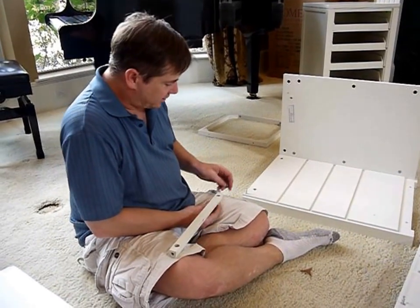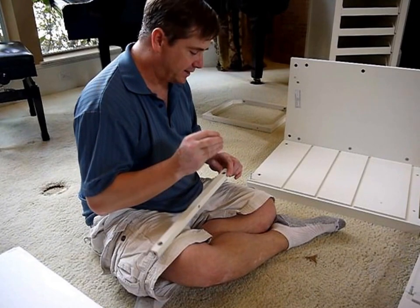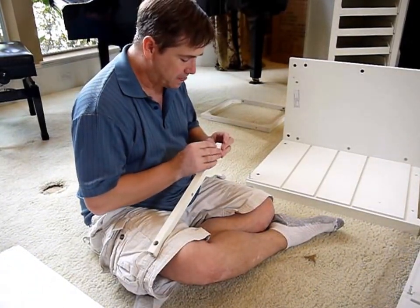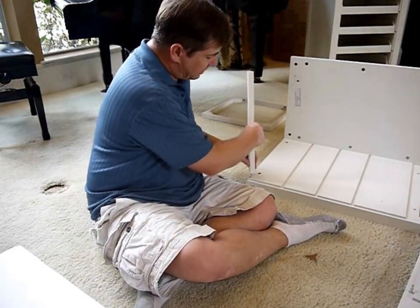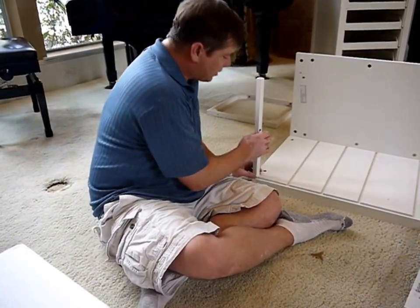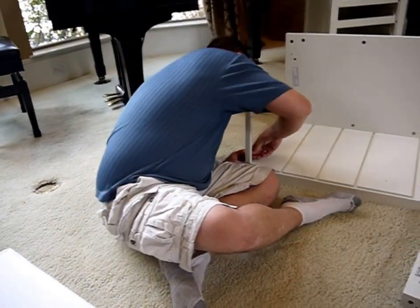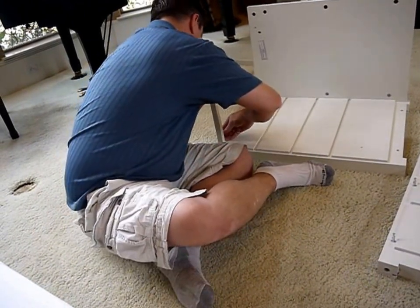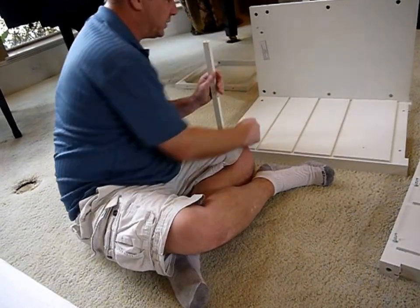Okay, and just like the others, you can just pop the cam lock, which is the sawdust in there, pop the arrow facing towards the hole, towards where that cam nut is, straight in there. This one actually does counterset a little bit, but because it's just the one thing that you're trying to do by itself, you can wiggle it on there and make sure that it's nice and firm, double checking the holes on the right side, getting my tool and pushing in firmly and down a little bit, and you can kind of just feel it locking in place. So you give it a nice little twist.